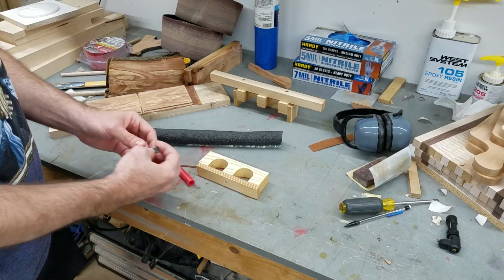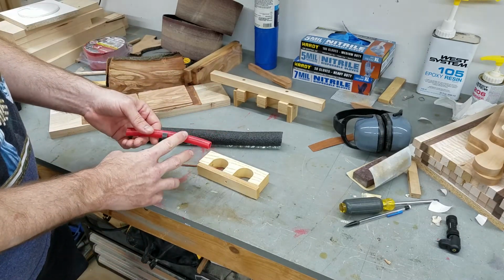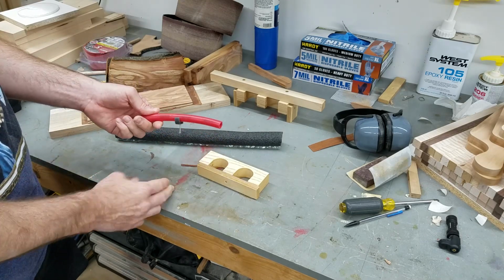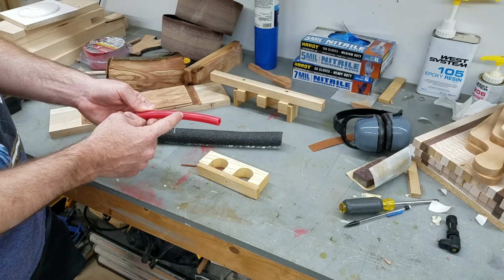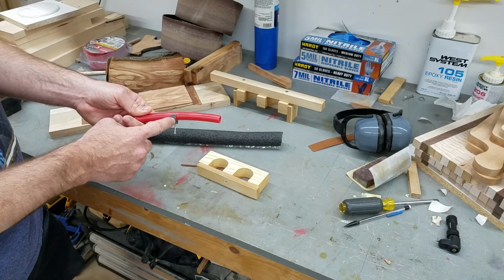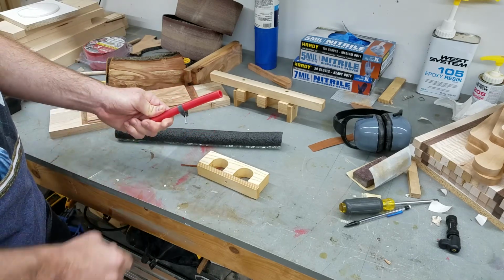Oh, another problem with these is that hot water pipe will expand after it gets some hot water in there. Again, it doesn't expand too much, but it's just enough that it will cause your pipe to flex a little bit, and that can put a little more pressure on these clips, which are also in contact with a pipe that's running hot water. So the clips get a little bit flexible because they're not extremely durable, and I've had quite a few of these things that have broken off after they've gotten warm and had a little bit of pressure from a hot water pipe pushing on them.